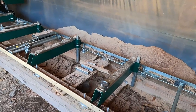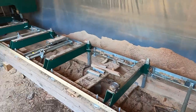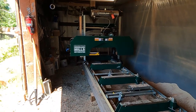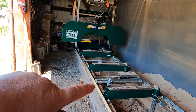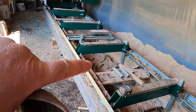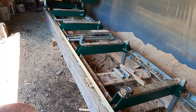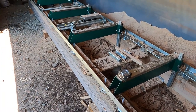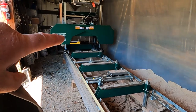Yesterday, we went ahead and pulled out the laser level, put the laser level down here at this end and pointed it down. That's how we've leveled this track before — got the laser level set right on the saw blade. Pulled the carriage down this way and then just about right here, two or three of these leveling bolts, the nuts had come loose. So this right through here had actually dropped — I would say a 16th, maybe at the most an eighth of an inch, but about a 16th of an inch drop to where the laser wasn't hitting the saw blade.